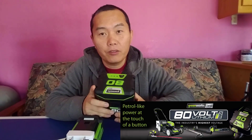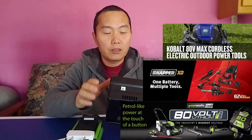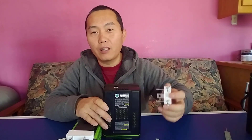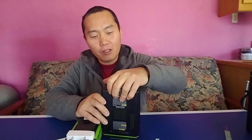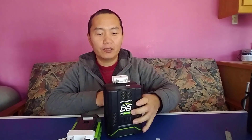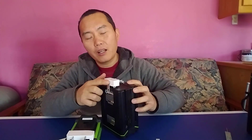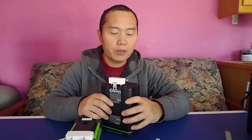For 72 volt, you can use an 80 volt battery. The 80 volt battery is very identical — on the market they're all the same. That's a really good thing, because you just make one adapter and it can fit all different brands. This is the 80 volt adapter, you just put it in there. You'll never mess up your positive and negative because there's a security pin — you cannot put it in the opposite direction.